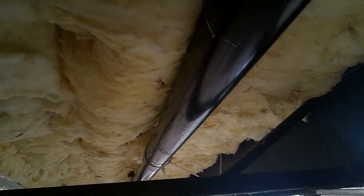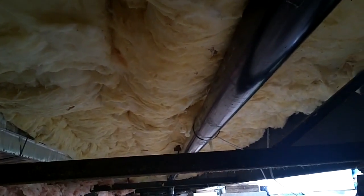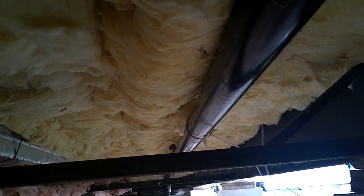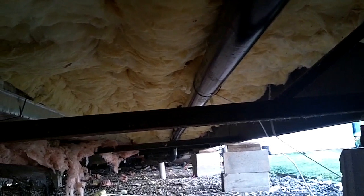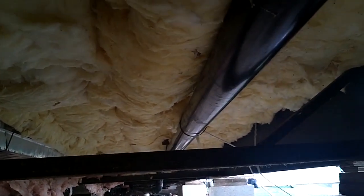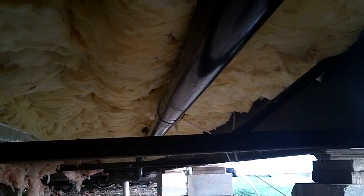So basically what I did was I filled each bay with insulation, and then I ran these lengthways to cover up all the pipes that I insulated with the polyurethane foam wrap, tube wrapping. So not only are the water lines protected now with a good tubing over them, I have insulated each bay, and then I've run this the distance of about 35 feet, maybe a little more.